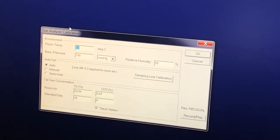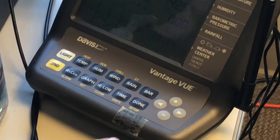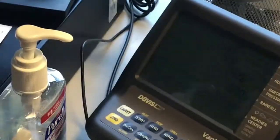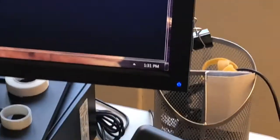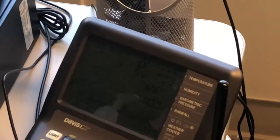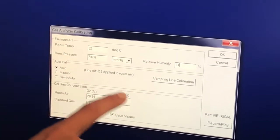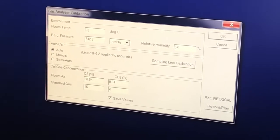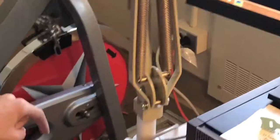We need to make sure it knows what the humidity and temperature are in the air, because that causes it to read differently — it changes pressures and space inside. On the top here we have the temperature in the room, so these things need to match. Room temp says 23, this reads 22, so we change it to 22. We then need the barometric pressure, which is 742.6 — very different from before. The relative humidity should be 54. You just need to match those three numbers. Room air and standard gas values should not need to be changed.